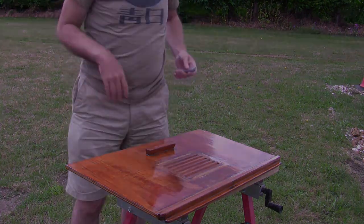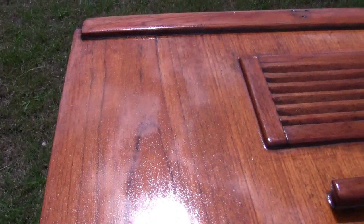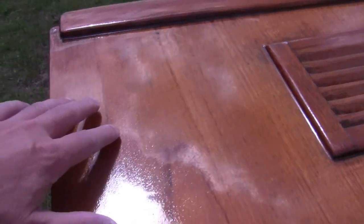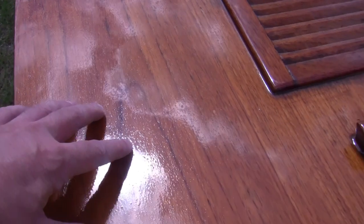I don't know. Right, bit of a disaster putting on the first coat of the 2-pack. I've done the other side and it was fine. I've done 6 coats on that, but something went wrong. I think it was reusing a brush that I hadn't cleaned properly, so I'm sure it's my fault. But it's gone very, very bobbly. It's not dust. I think it's bits of half-cured varnish. I don't know what's gone on there.